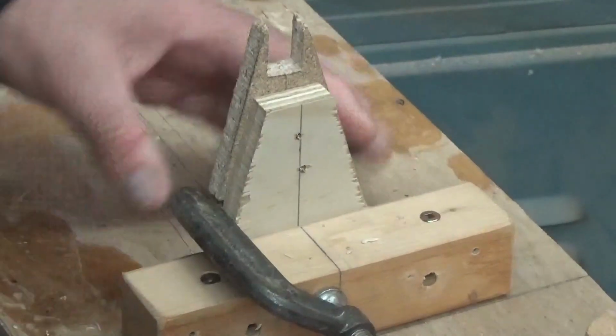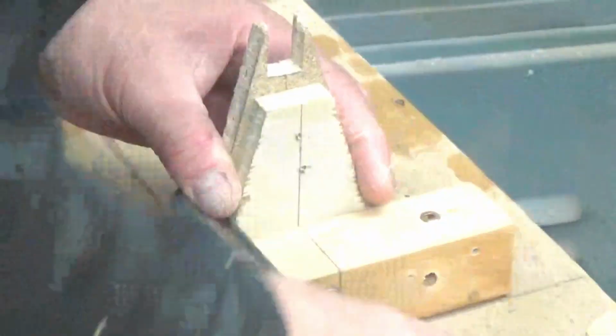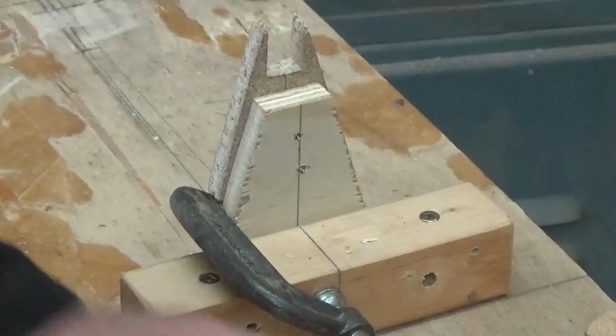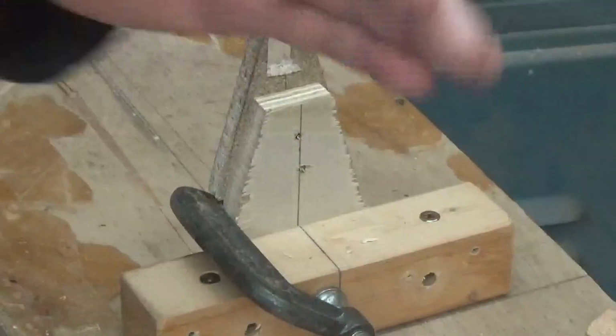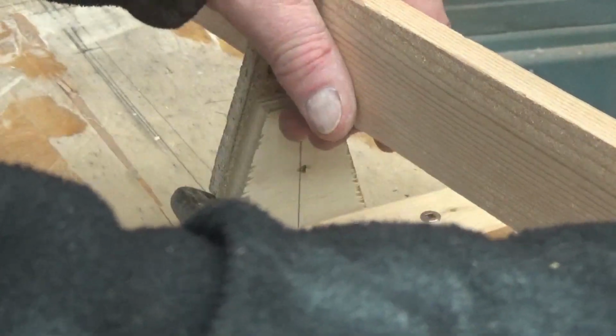If it's sitting on top of the beam flush and the center line's lined up, I'll be able to adjust it when we get the stem itself in, which will sit here and extend beyond. And then I can check to make sure that this is a string line, laser line, straight out the end of the boat. Then we shape the stem and start putting some planks on.